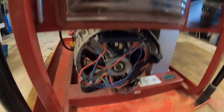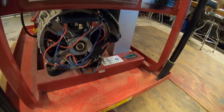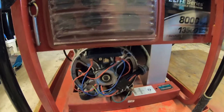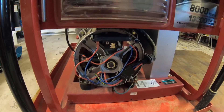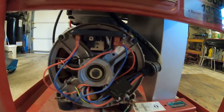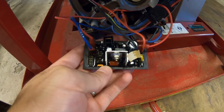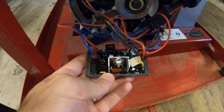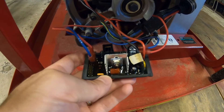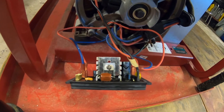I got the back of the gen head pulled apart. I took this plastic cover off — it's just a couple of nuts, I think four or five 7mm bolts. Here not much going on: you have your rotor shaft, the ball bearing that holds it. The other side of the generator shaft is actually tapered into the crankshaft, so there's only one bearing. You have your brush holders right here, and up here you have your AVR. This is where I think the problem is. I don't see any obvious problems but this thing is pretty heavily potted with epoxy — I'm assuming for dust and water ingress, just to protect it. So if there is a failure, there could be a failure underneath that epoxy that we can't see. I don't see any obviously bad capacitors or anything that might suggest there's something wrong with it. But I have another one on order and this part number has been changed like five or six times, so I'm guessing these things have been problematic.